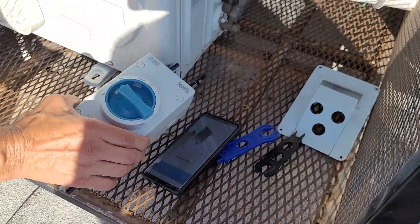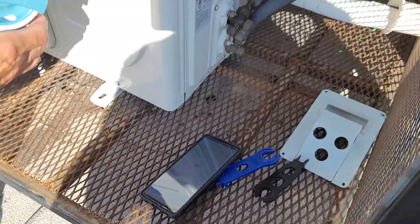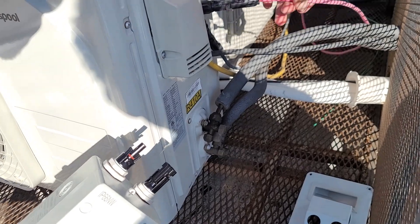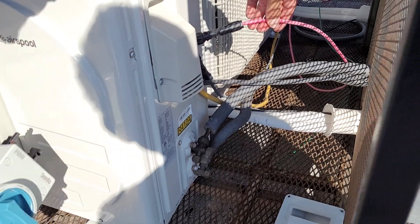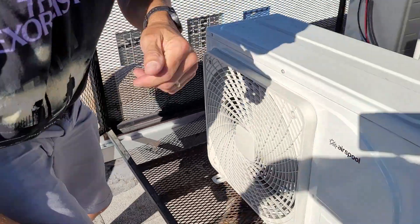This is the isolator — you should install this somewhere outside on your wall where your DC solar wires come down from your roof. It should be near this outside unit, because if you're going to be working on it, you want to be able to turn this off from a convenient location. Check out and subscribe to AirSpool.com for this whole series on how to install an Air Spool unit. It's also helpful if you have a normal mini split or are installing solar panels on asphalt shingle roofs. We'll catch up with some other videos soon. Thank you.